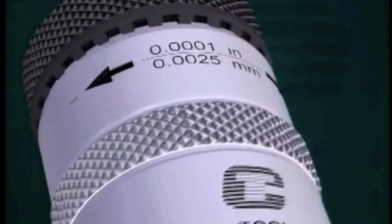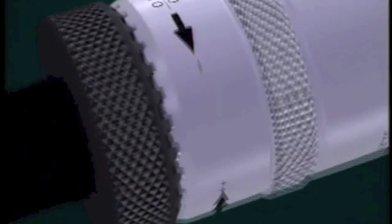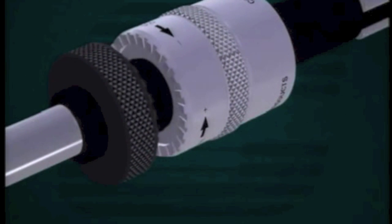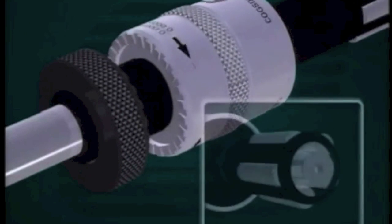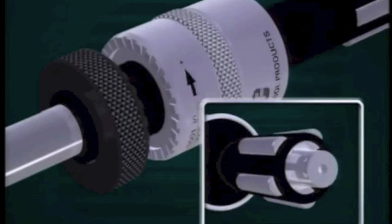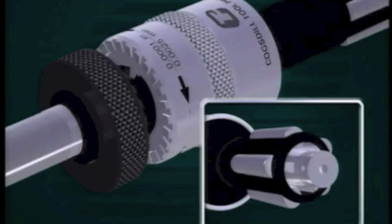The adjustment procedure for all roller finish tools is basically the same. The tool can be adjusted in one ten-thousandth inch increments over a total adjustment range of forty-thousandths. A rear castellated adjusting collar interlocks with a threaded and castellated bearing collar to keep the tool in adjustment. To change the tool's adjustment, simply retract the spring-loaded adjusting collar and rotate the threaded bearing collar.